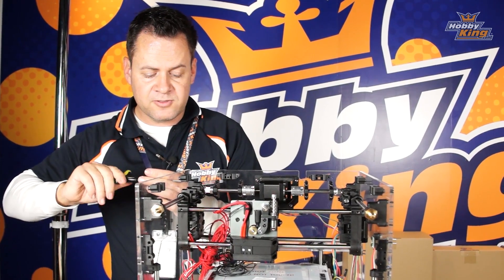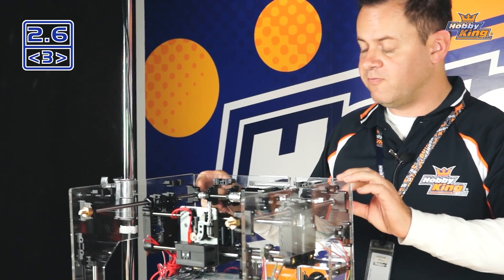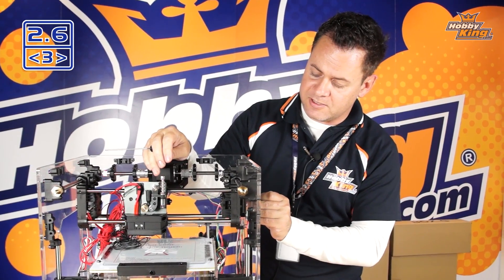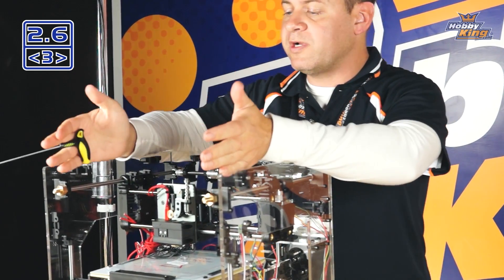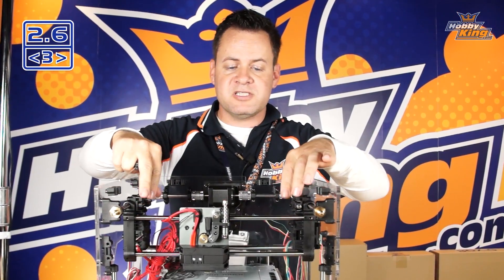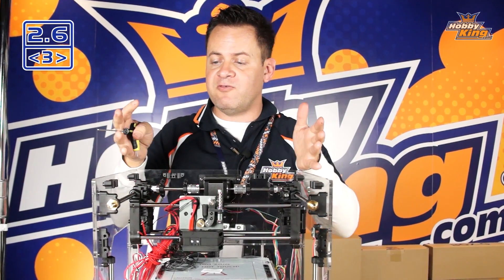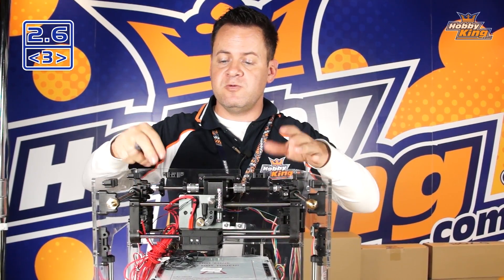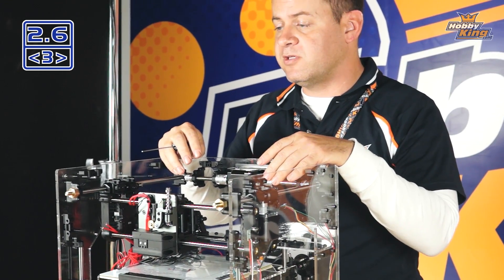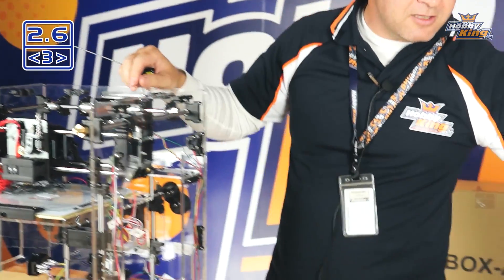Now that the hardware is installed into the sides on these rails, I'm going to give these a snug. The nuts on the back we're actually going to leave a little bit loose because we're going to do some tramming. These rails are in a defined dimension and we're able to slide this back and forth — see how easily it glides. We want to maintain close to this amount of drag. If we start squeezing in the sides it's going to jam and put tension onto the bearings. This process will tighten things up while finding that nice happy medium, as described in the manual.